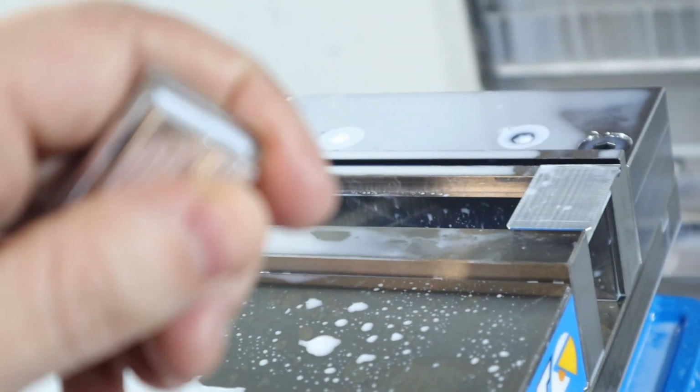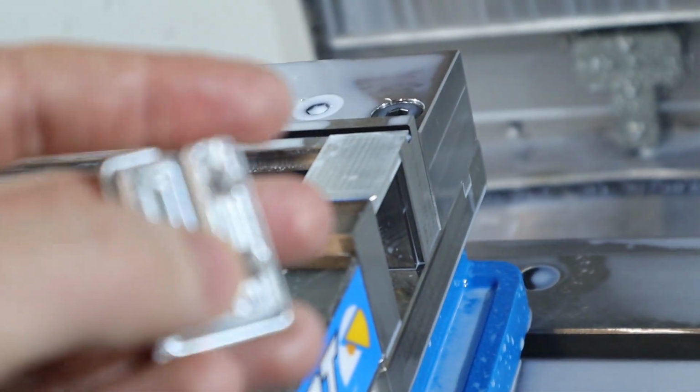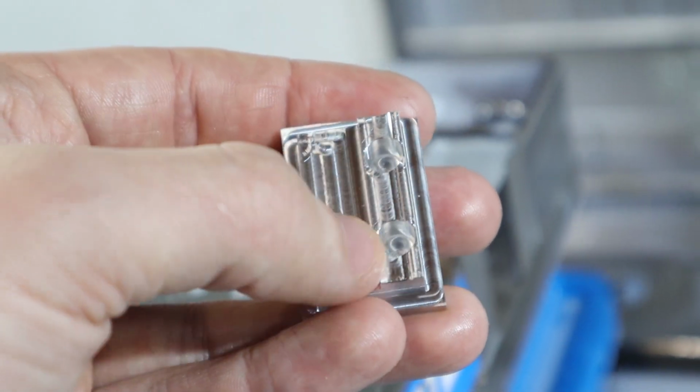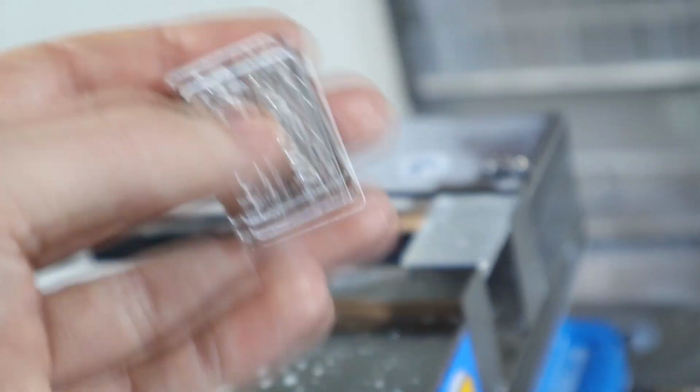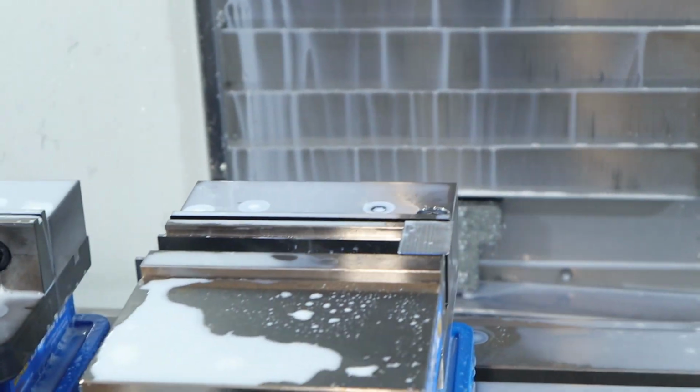So here's our part. The part is actually resting here and not here, so obviously it thinks the part is actually taller than it is supposed to be. So I just updated it and sketched the point between this midpoint on this plane, and that should fix our problem. Or crash the machine. We don't really know until we run it, so yeah, let's crash the machine.